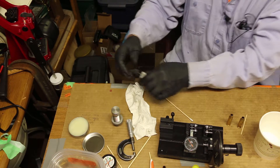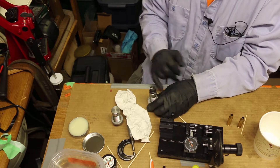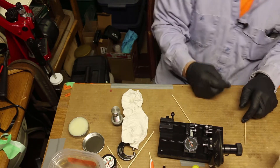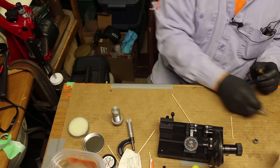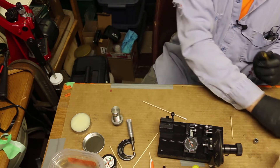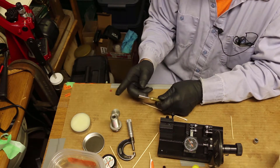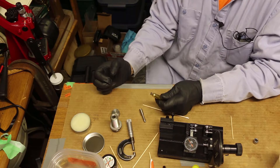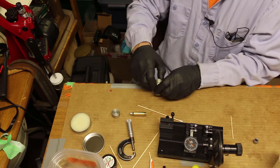Here's a 288 — drop that in there. The way you do this: they want that bushing to float, so I put a little mark on the end, come down, tighten it, loosen it up a quarter turn, note the split ring lock ring. They want that neck sizer bushing to float in there. So this is 289 — we're going to mix these in with the 262 cases. This sized with a 289 and the 263 mandrel fits into it. Let's run some lube on it with the 288. The 263 mandrel did not fit it — this might be the way to go. I can get them all the same by running the necks through the 288 and then running the 262 mandrel on all of them. I'm basically shrinking the necks down small enough so I can size them using this neck sizer, maintaining concentricity.